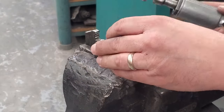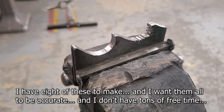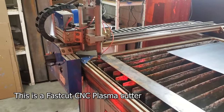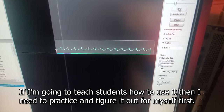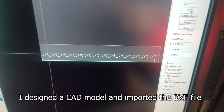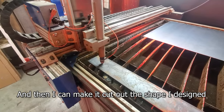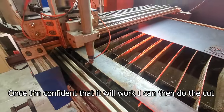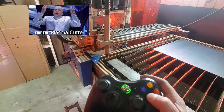While I love using a grinder and all these power tools it gets a little bit tedious. I used a one inch round piece of steel with a one inch round sanding grinding disc in my air tool, and then I changed my mind and decided to program it into AutoCAD as one long piece. We recently got a FastCut CNC plasma cutter — this thing is phenomenal and has changed the way we work in the classroom. This is actually the first week I ever used it — I'm not releasing this video until about a year after filming. The material costs about three or four dollars per foot.